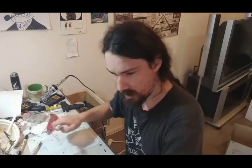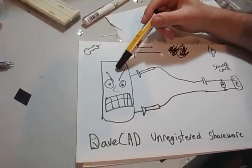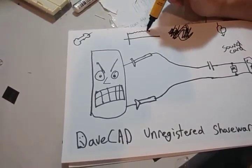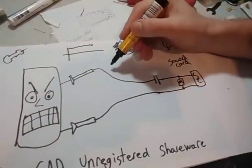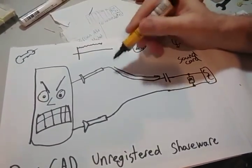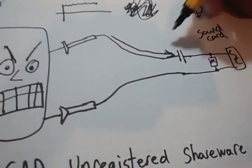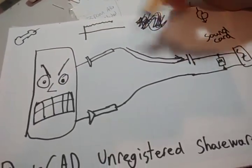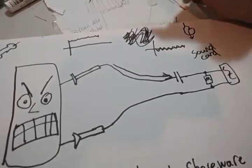So what you do is you put a capacitor in — let's draw it. This is our signal source that we want to test. He produces signals, and the signal will most likely have a DC offset, like a power supply for example. If we have the signal going through a capacitor, the DC and AC go through on the input side. Once it reaches the capacitor, all of the DC will be stripped off. There'll be no DC going past this point, and on the output side we'll just have the AC wiggles.